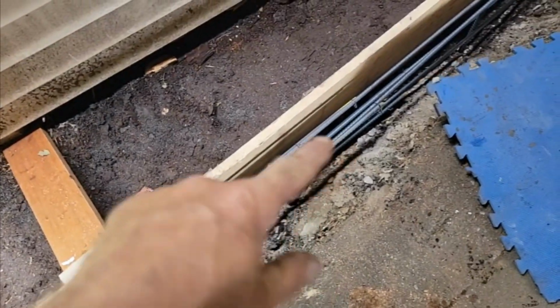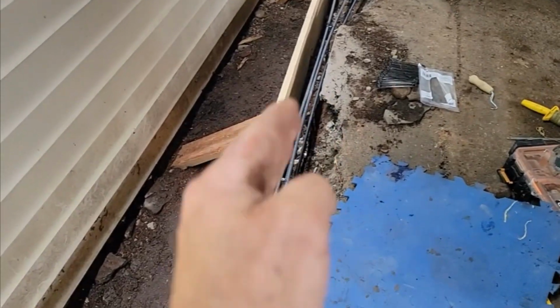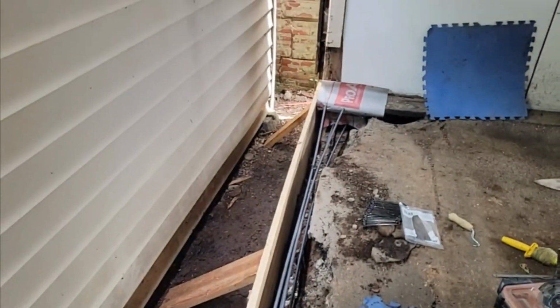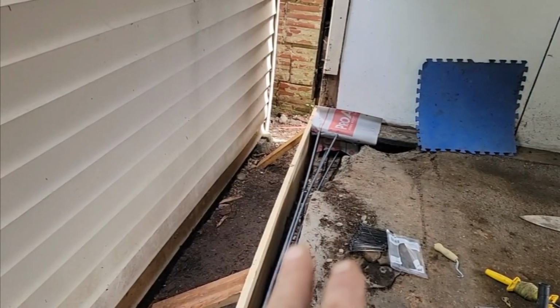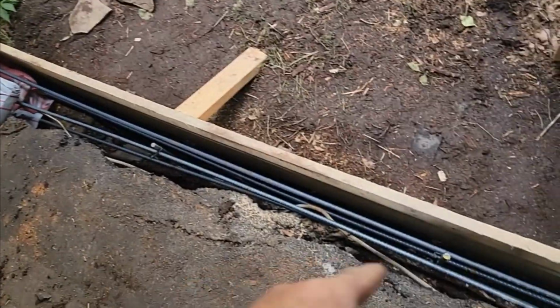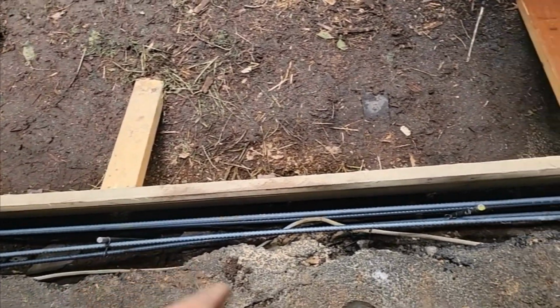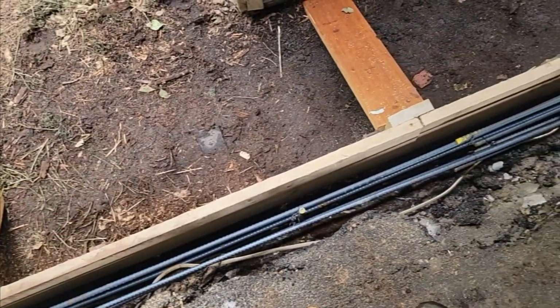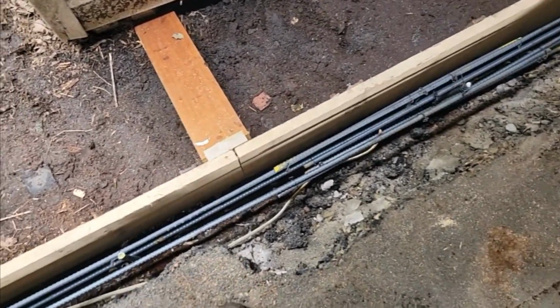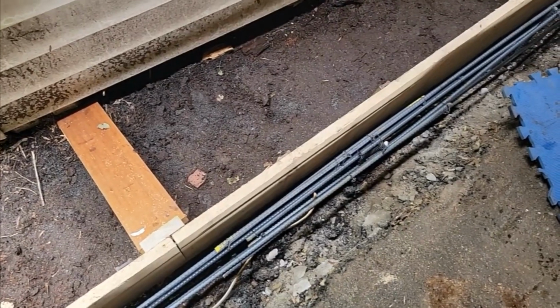Well, we didn't weld up a square like we probably should have. But this is irregular down through here. It gets tight and wide. But we're secured in the 4 ends. We got paper separating the wood. Same thing. We had that wire just thrown down in there. We got it tied to some verticals. That'll keep it from trying to move out. And we got 4 rows and they're overlapped. So it should be pretty rugged.